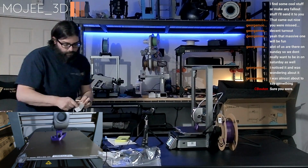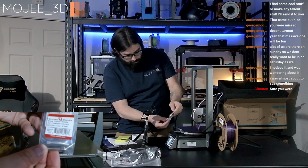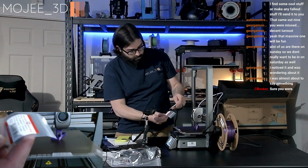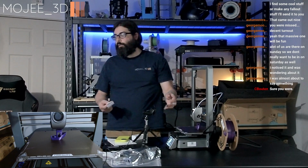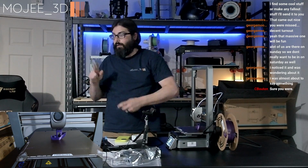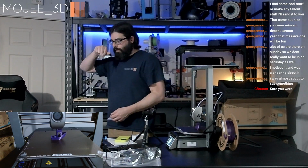Yeah. So I've got these, these are them. The Microswiss Flowtech. These are for the K1, but it has a 0.4 in now. They come with, I think, 0.2, 0.4, 0.6, 0.8. So these are the 0.6 and 0.8. I am going to put an 8 in that K1 because that K1 is primarily